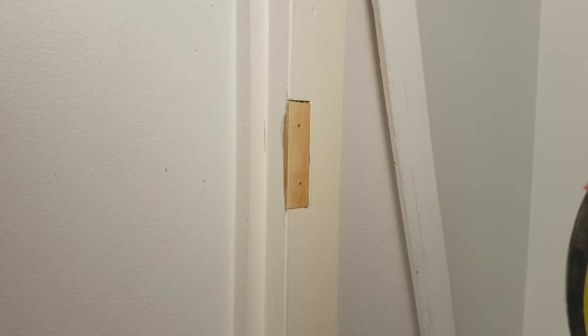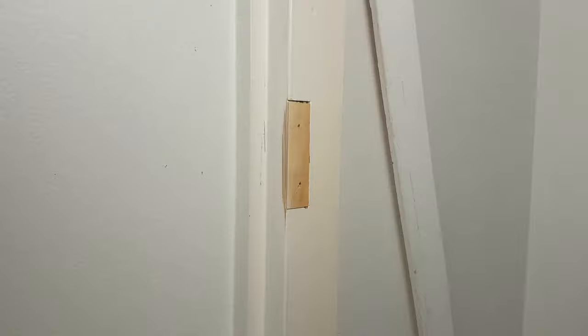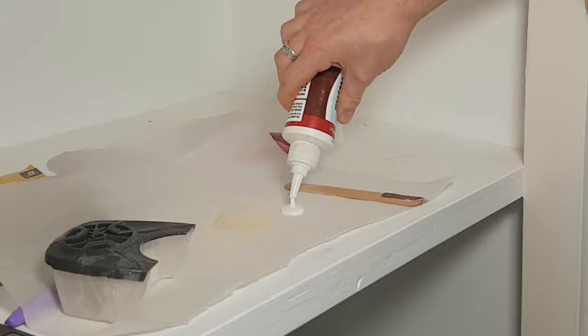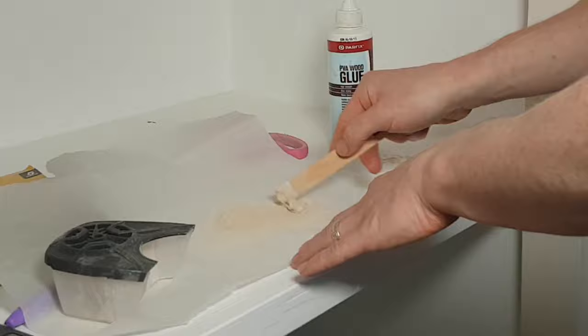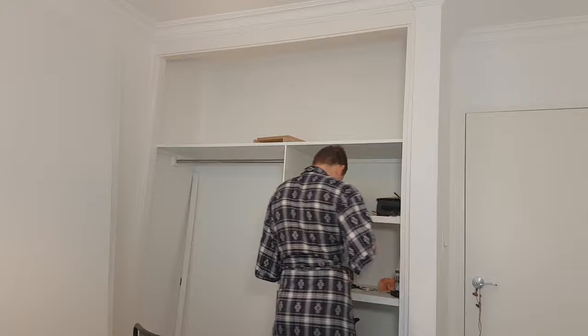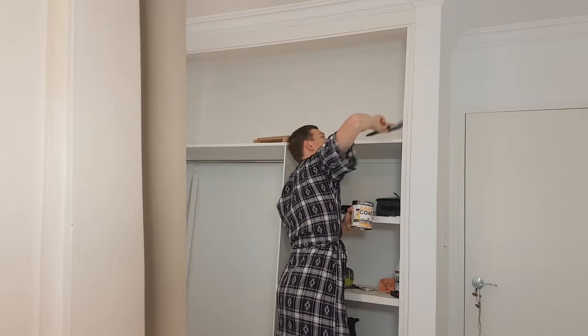I DIYed a Diablo sanding net onto my little mouse sander, then took out the dust from that sander, mixed it with some white PVA wood glue, and made my own wood filler — because I'm not really supposed to be going out to the hardware store right now in the current climate. Filled the voids, made them look pretty, sanded back, and came back to put some paint on. I ended up repainting the entire frame around the door — cut it back, then a few coats of undercoat and trim paint, same colour as the doors.